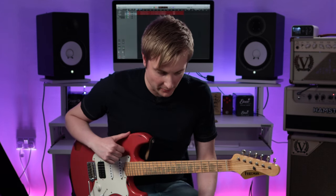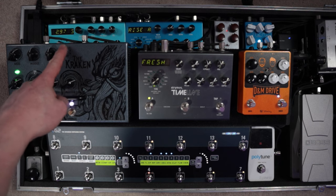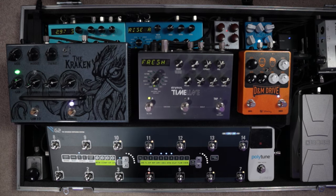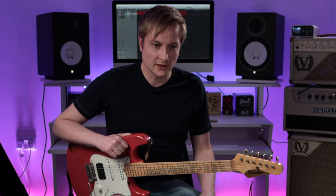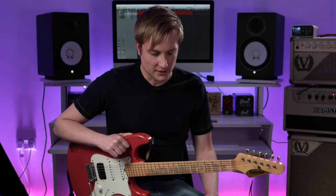Before we look at gain two, let's have a look at the little toggle switch up here — this is our bright switch. At the moment I've left it in the zero position. The purpose of this bright switch is to tame how much high end there is in the signal. You can use this unit with a whole range of different amplifiers, and different power sections respond completely differently and have different EQ curves. So for some amps we might plug into the power section and it sounds way too bright, too brittle, or too dark. You can adjust this three-point brightness cap to adjust the overall brightness level of the pedal.